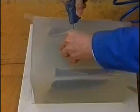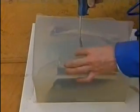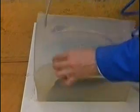As soon as the silicone has hardened and the casting frame has been removed, a shot of compressed air is blown inside the mold through the gate so that the mold comes off the master model evenly.